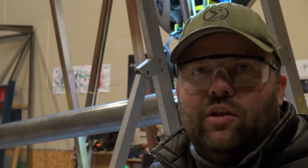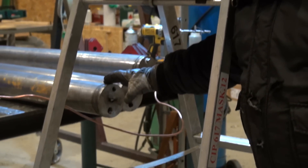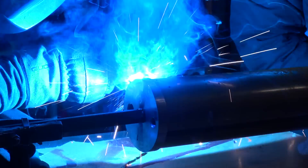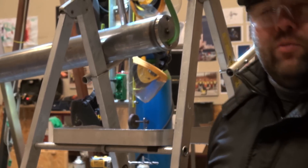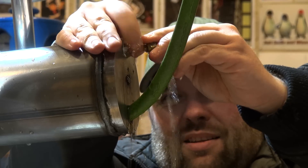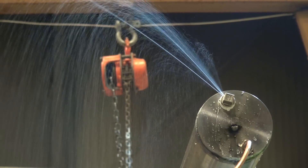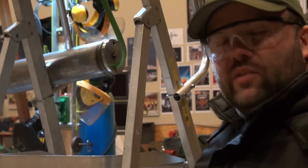The process is actually pretty simple. We have some welded plugs in place on the standard pipes — on the other end all of those plugs are completely closed. We have a filling port here, that's a big one, and then a smaller port for pressurization. We fill the entire pipe with water so that there's as little or no air left in the pipe, then we plug both the filling port and add the pressurization mechanism.